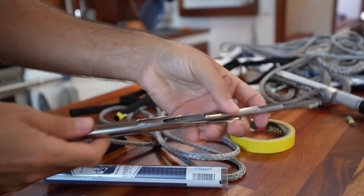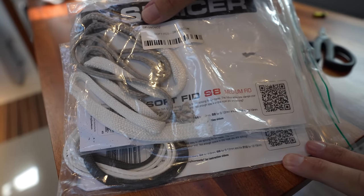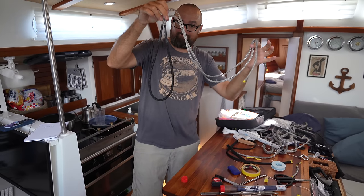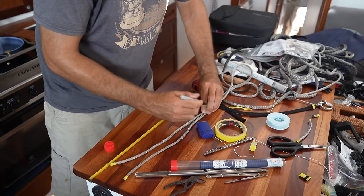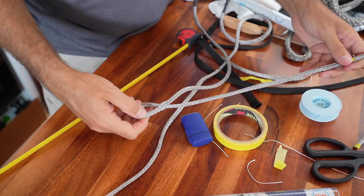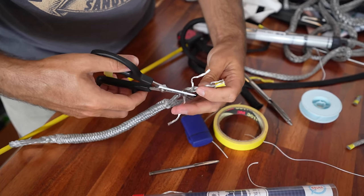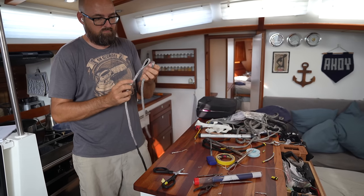On a side note, if you're going to be splicing annoyingly tight double braid I recommend picking up a set of soft fids — they make getting started a lot easier. I milked the cover over the Dyneema using one of the fids. With the cover placed right in the middle I whipped the cover and covered the whipping with a bit of heat shrink. The next step is to add two eyes, one at each end. I multiplied the diameter of the Dyneema by 50 and used that as the length to the start of my eye. The eyes are made with a Brummel locking splice — run the working end through the second mark and the other end through the first mark, and you have a super strong eye. The last step is to bury the working end and taper the end for a nice result. In about 10 to 15 minutes: my very own DIY snubber pendant.